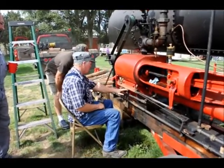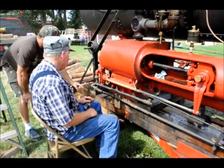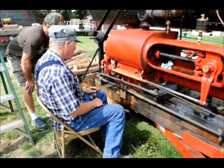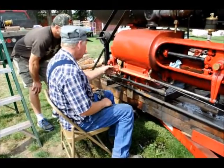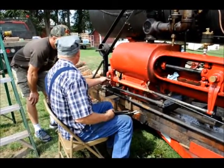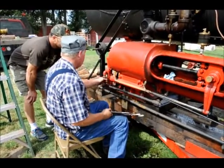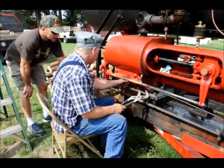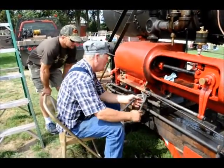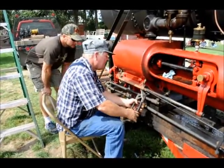This is just as simple — the rod goes that way and then creates a suction. It's like a check valve. I looked at that when I restored this and asked an old guy — he said that rod just in there had no packing whatsoever. It's just cubic inches: you have more cubic inches when the rod comes out, so it sucks it in. Then when the rod goes that way, it's less cubic inches and puts water in. And if that packing was leaking, it would leak.